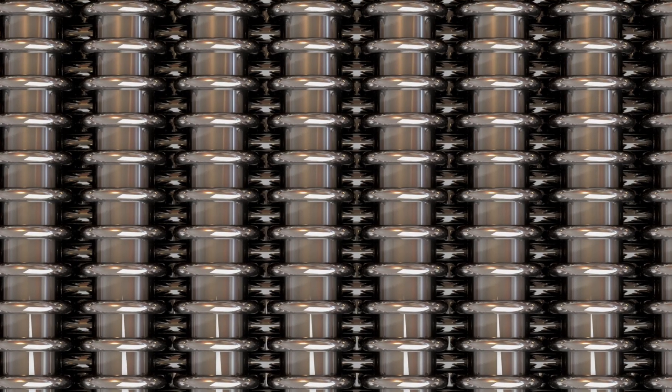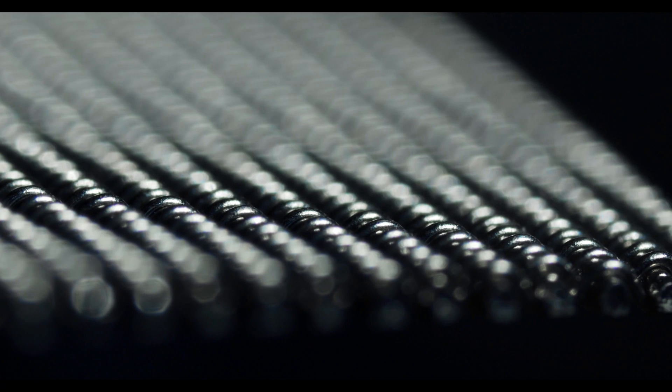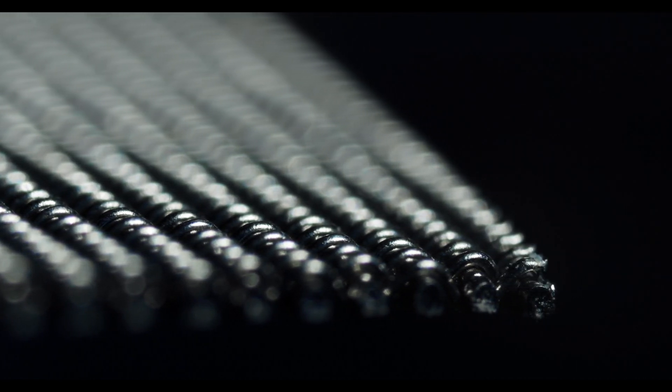A wire cloth filter is a calculated arrangement of metallic wires woven together to form a uniform series of precise openings. So when designing a mesh filter, specs like layer configuration, size and shape, and mesh count have to be methodically planned out. Filter mesh can be constructed out of a lot of alloys like Alloy 310, Inconel 600, Super Duplex, Duplex, Hastelloy C22, and Titanium, but 300 and 400 series stainless steel are the most widely used alloys as they have the perfect balance of performance and cost effectiveness.